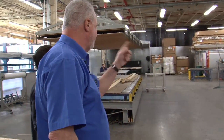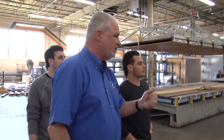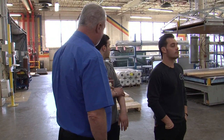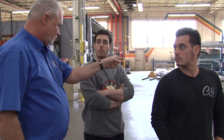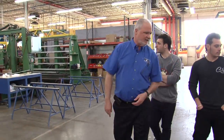We put the vacuum beds in here after they're assembled with the honeycomb inserts. We'll keep these under pressure for 24 hours. And we'll put 2 pounds of air pressure on that bed, and 2 pounds of air pressure will bend those I-beams if you go to 3. You know, when you're printing on graphics, everything has to be extremely flat or you'll see a color variation.